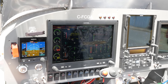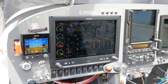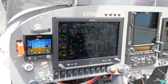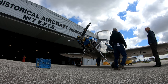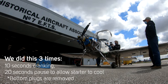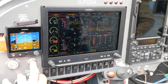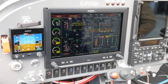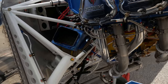Keep in mind, we're spinning at low hundreds of RPMs - like 200-300 RPM. Our oil filter is almost certainly empty. We're pumping oil through the system, just to get the head pressure there so that when it does start, it's pretty much pressure. Clear prop! That's 10 seconds - it's coming up now. We've got it - it's in the yellow, it's 40 PSI, so we're good. Bottom plugs are going back in. Then it's really just validating that the EGT, CHT, oil temp - all that stuff is coming up over the two minute period.